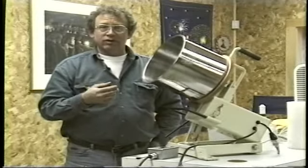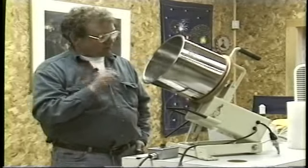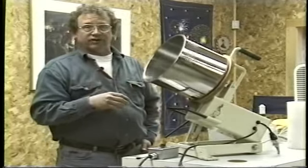Well, Harry, how can you tell that it needs water? Well, I look for the cores to have a dry look on the surface rather than a glistening wet look. And I look for a dust trail up here. And all that tells me is that they're not absorbing any more dust yet. They're just not taking any more. When they get to that point, I know it's time to give it a hit of water so they'll start to take up dust again.